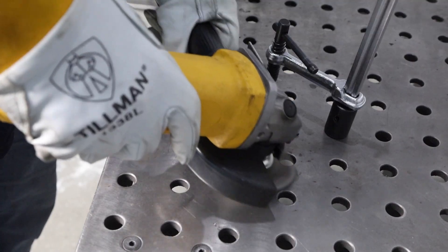So there's your tip. If you have to weld on both sides of some steel, it's a good idea not just to clean your material beforehand, but let it cool off a little bit in between your welds, brush that oxide layer off, wipe it down with acetone, and you're ready to go.